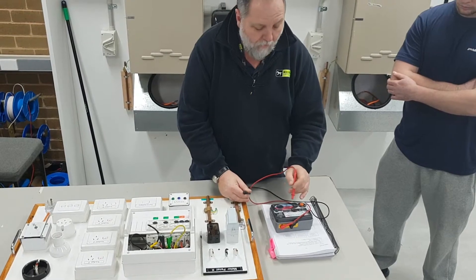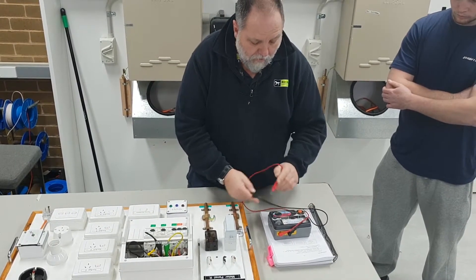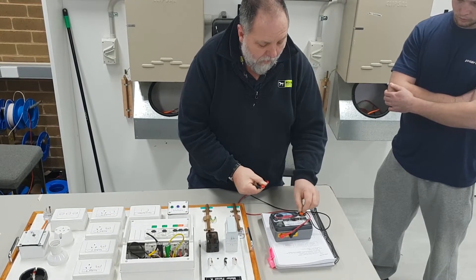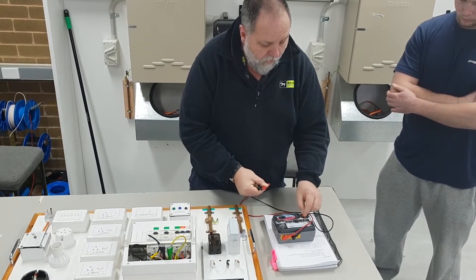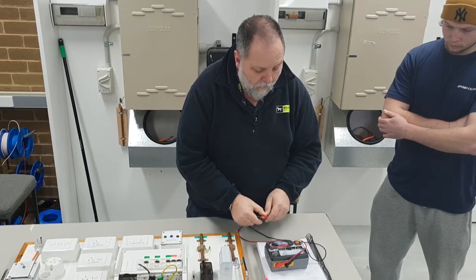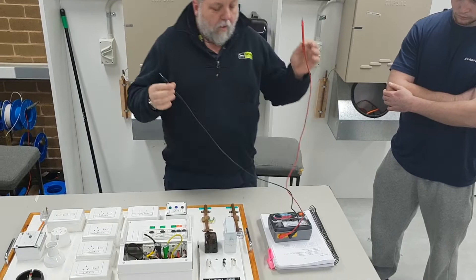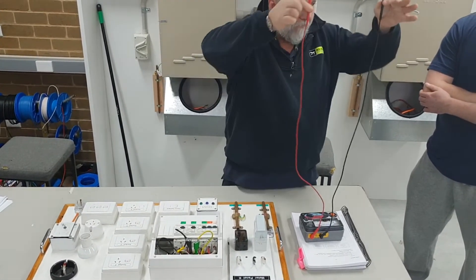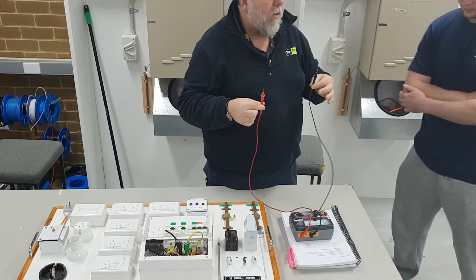It could be something like five or six ohms. I'll zero that - okay, that's zeroed. Then I'll take it to 500 on the red scale and zero that there perfectly. Zeroing it also makes sure your leads are good - we don't want faulty leads with joins giving us faulty readings.